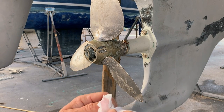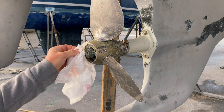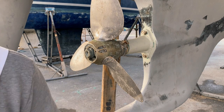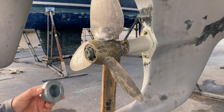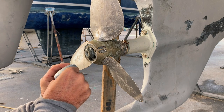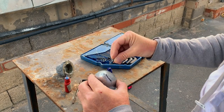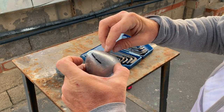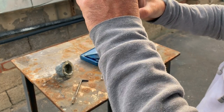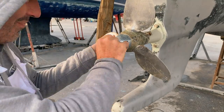The next job is to clean the screws — remove any scale, mud, or debris from the threads. Once done, clean any residual mud from inside the prop. Then we reapply the anode: first offer it up to make sure it's the right size and the screws fit, add a drop or two of thread locker, tighten it up, and screw it in. Simple job — should take you less than half an hour.